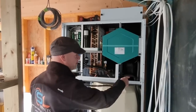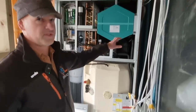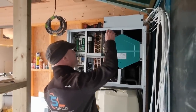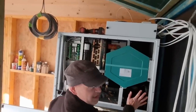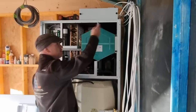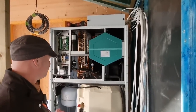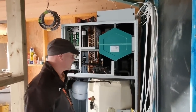The first thing it does is the fridge line comes straight in and the condenser starts in the tank, so it does the hot water off the heat pump as well - does a tank full of hot water. Once the hot water is satisfied, then it will charge this coil here. Every bit of air that then comes across comes in through a port down there - there's actually a tube at the back, this is the fresh air chamber. So when the compressors run it heats it slightly, then it comes through this block, heats it even more with the 20 degrees from your inside like normal MVHR, and then this raises it even further still. Incredible. Basically it's a plant room in a box - I think it's the simplest thing to describe it.